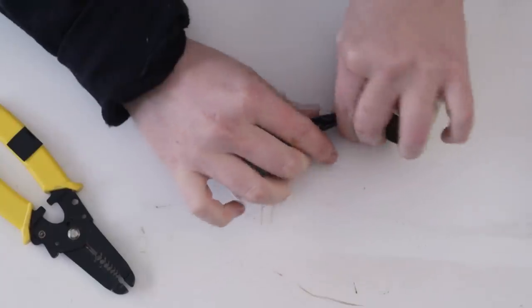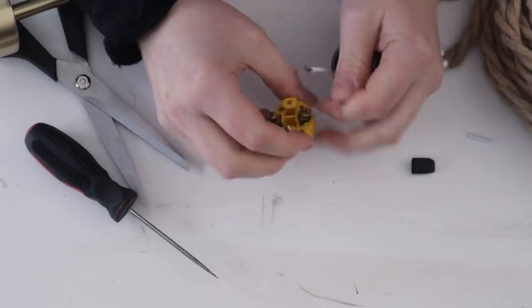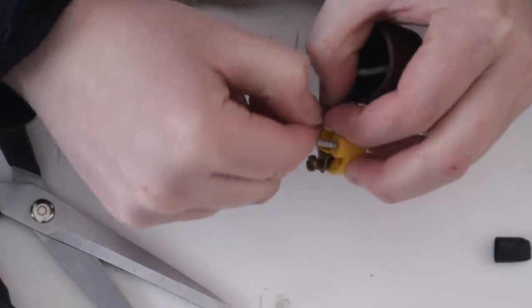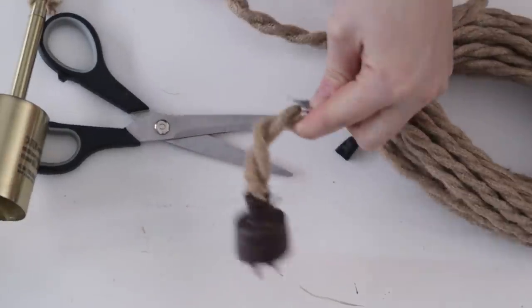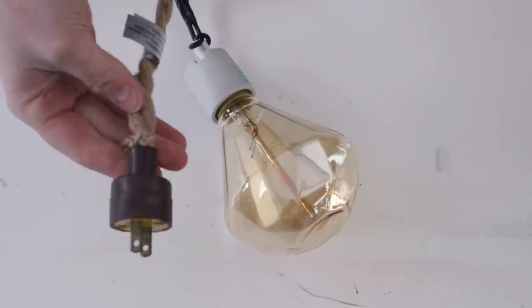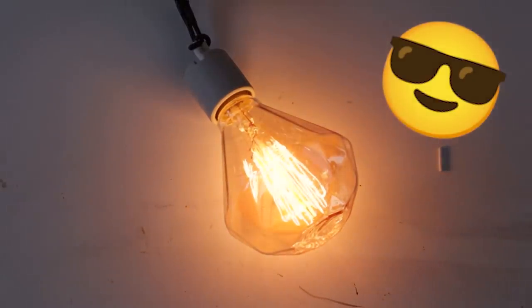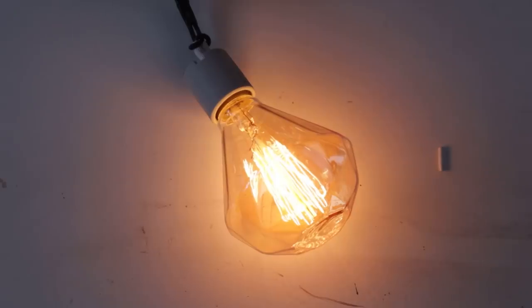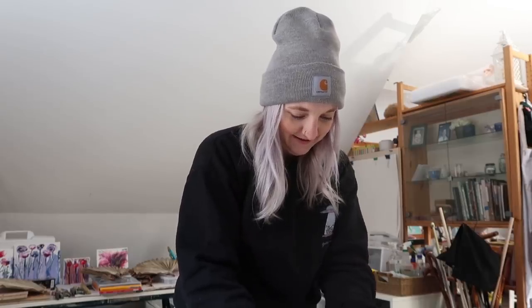There are two sides to a light, so before reattaching anything I needed to add my plug. I have this old two-prong plug that is super simple to connect — I pull off the rubber cover to expose the inner workings, feed my two wires from the hemp cord through the rubber cover, and connect my hot and neutral cords to each side of the plug, then secure the body back into the rubber cover. Always test the connection to make sure your light works before screwing everything back in place — and look at that, we have power my friends! Can we just take a minute to say that light bulb is totally rad. I sourced it — it was super expensive but I think it's beautiful.